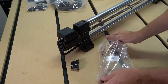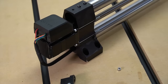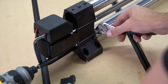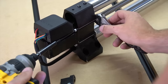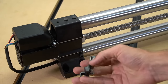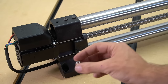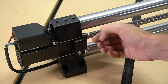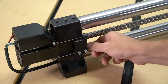You'll also notice two smaller bolts with three millimeter heads already threaded into the plastic bracket of the drag chain mount. We're going to use this to secure the drag chain raceway to the rail itself. We'll insert our longer four millimeter head bolts with nuts — putting a nut on each — then install the drag chain bracket itself. Here we're using a four millimeter hex key as well as an adjustable or eight millimeter wrench to tighten these down. Then we are going to install our bracket over the top of these nuts. If you look at the drag chain bracket from the left side, you'll notice recesses that line up with those nuts, and we'll put another nut over the top to secure it. We'll use an eight millimeter wrench, adjustable wrench, or an eight millimeter socket with a ratchet to tighten these nuts down and secure this bracket to the end of our rail.